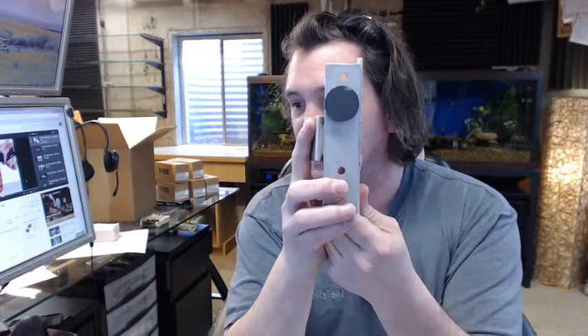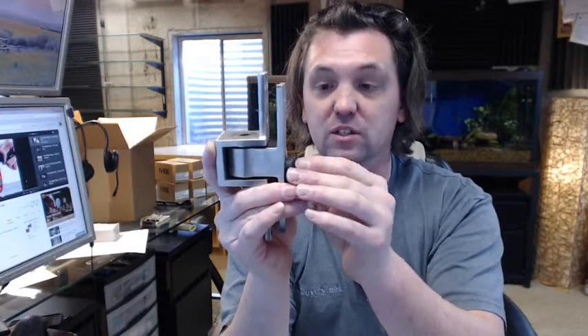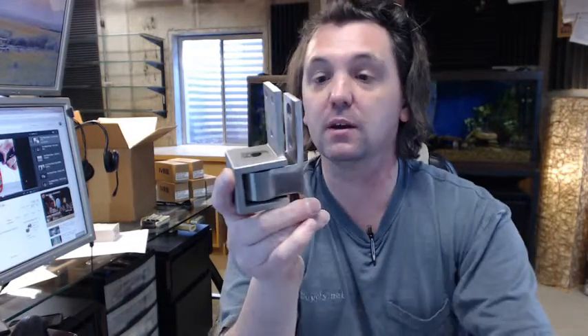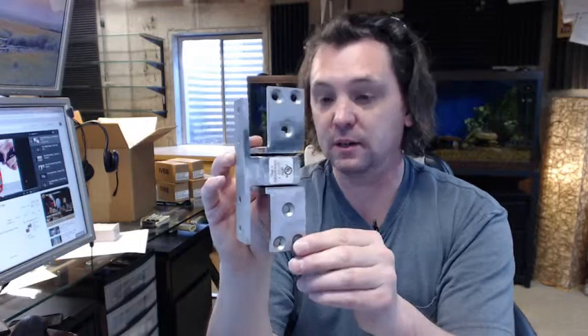These hinges will work on fire doors, no problem. The hinge I have here is a stainless steel base material. It is slightly magnetic — I don't know exactly what amalgamation of material is in this, but likely to be fire compliant it may be a different sort of stainless, since it is ferrous-based or slightly magnetic, not significantly so like plain steel would be. This is the 32D finish, available in several architectural finishes.